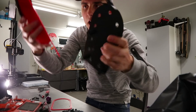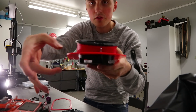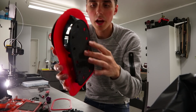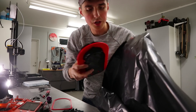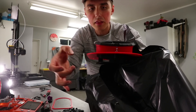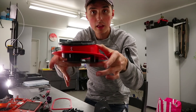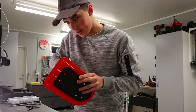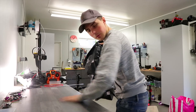The next installation is this bottom piece — these are the outlets for the air. The air gets propelled in through here, and then we have the skirt all around the edge. On the bottom side we have these bleed holes for the air to actually hover the craft. The skirt — which I will change to a plastic bag — goes on the outside, basically just creating the air seal for the air to be pumped out and actually make the craft hover.